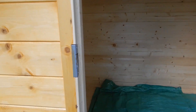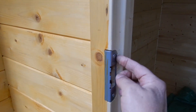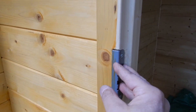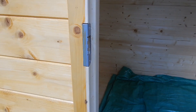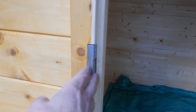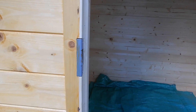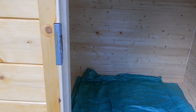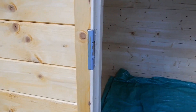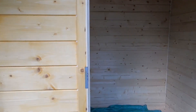The other thing I found was this latch plate — we had to cut it back more into the wood because it was sticking out too far. When it was pre-built they just put the latch out too much. It may be a manufacturing issue common to doors that come with Bunky Life kits, but just be aware of little things like that as you're putting this together.